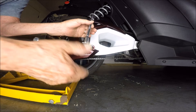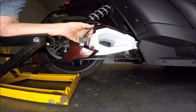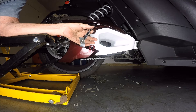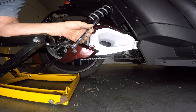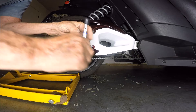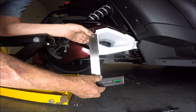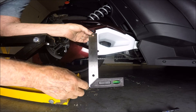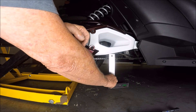That's 0.30 inches for a new belt and 0.40 inches for an older belt. As you go through the life of your belt, you can go closer to the 0.40. This equates to five-sixteenths of an inch for the 0.30 and seven-sixteenths for the 0.40. I also have an angle tool — basically a square — to help read the measurement.